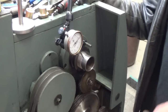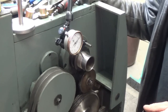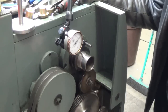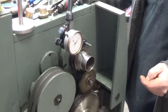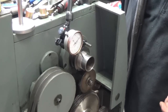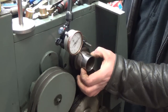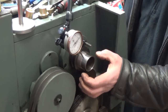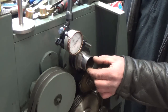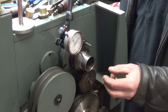So now, I didn't buy this lathe brand new. It was a year and a half, 2 years old. There's an old gentleman that bought it. He wanted to try it and just decided he wanted to sell the machine again. So I bought it from him and I just assumed everything was in great shape. So when I did my measurement here, I had measured in close to the threads to get my diameter. It turns out that out at the outside end, this thing had been bell-mouthed quite a bit. Now, I'm starting to wonder if he hadn't had an accident from not using a spider before.